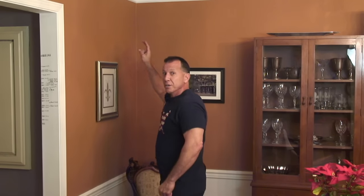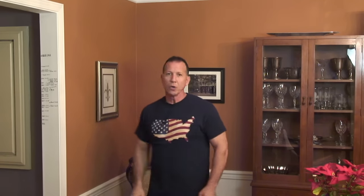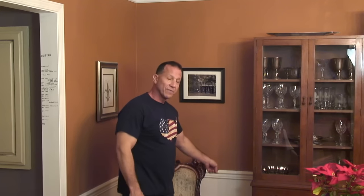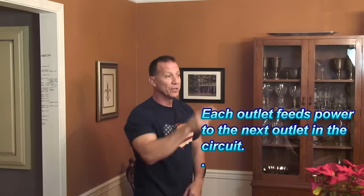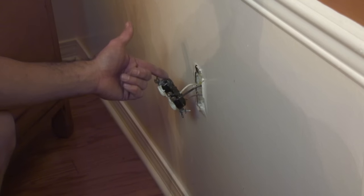If they drop these wires for the feed down this wall, there's a doorway on this side, so this is going to be my closest outlet — probably the first outlet that feeds the room. If I check this outlet, it should have four wires in it: two come in to feed it, and two go out. Every once in a while they'll route it through another room, so if this isn't the first outlet, the one on the other side of that wall will be. After that, it goes from outlet to outlet — four wires on each one. The last outlet should have just two wires, because that's a dead-end outlet.